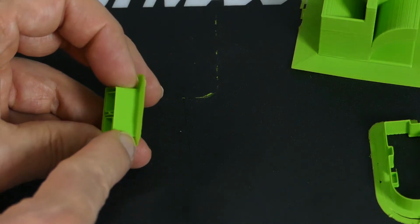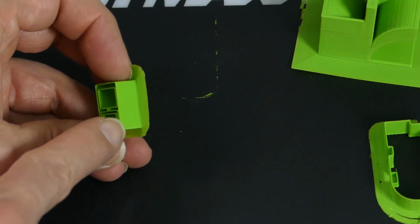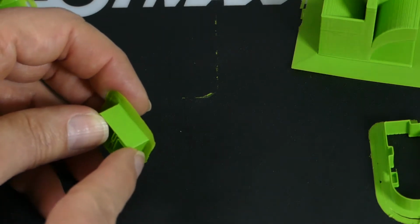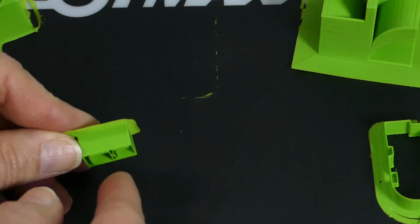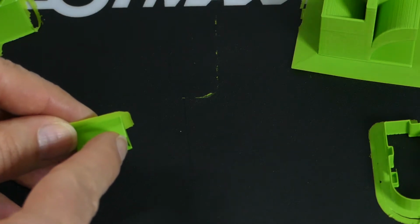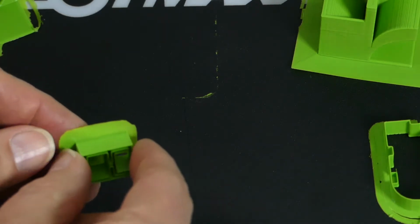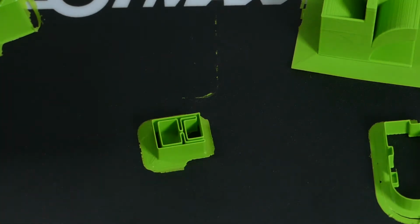We do have some noise in here, which stems from the z-axis movement. Basically, the printhead has to stop for a very short time when the z-axis is moving, and this is actually visible in here. And although the z-axis is reasonably quick, apparently there is some noticeable oozing while it's stopped there. And this could be addressed, but it's not really necessary.